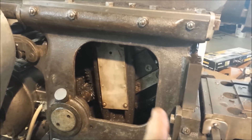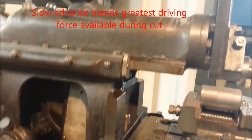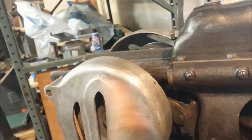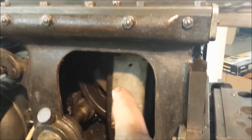I'm going to show the scotch yoke here in operation - just how smooth that is. Everything's great on it. The ram actually advances slowly and comes back quickly - slow out and a little more quickly back. That has to do with the position of the driver on this vertical member as the slide is advancing. That's another advantage to having the motor running in one direction - it gives you that slow outward stroke, which gives the maximum force of the cutting tool, and a fast return, which saves a little time. The longer the stroke, the more noticeable that speed difference will be between the slow outgoing and the fast return.